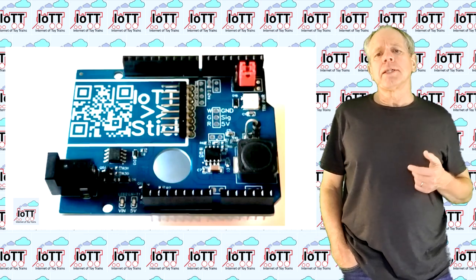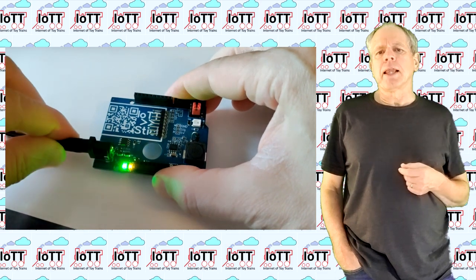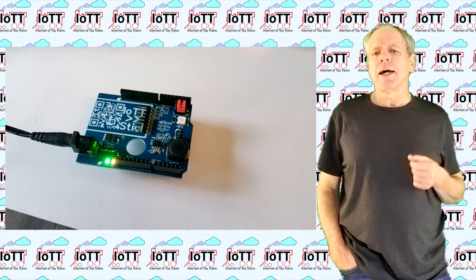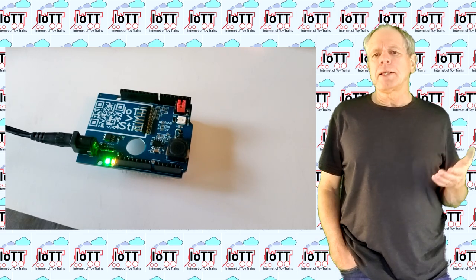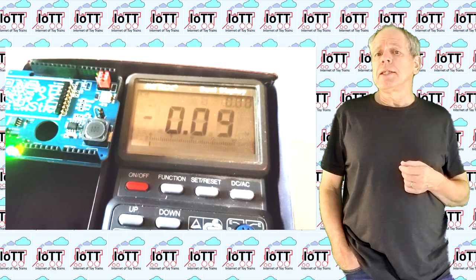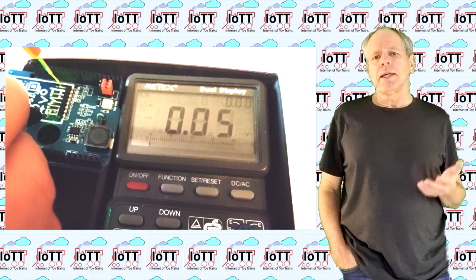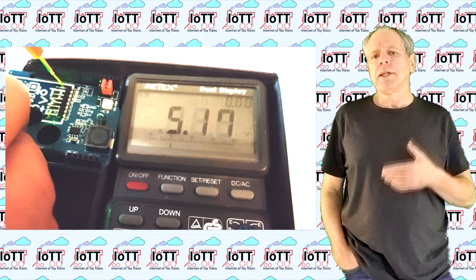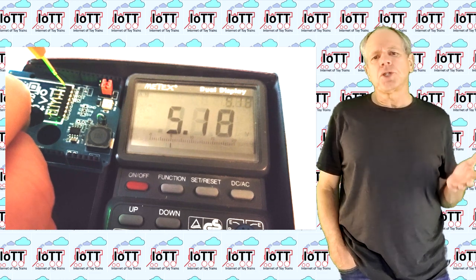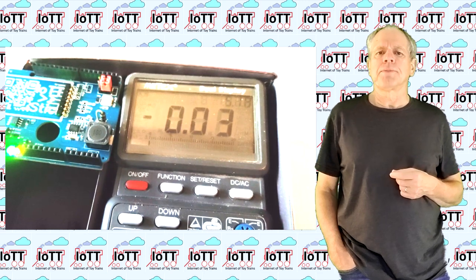Next, we install the DCC AUX board. This board can be tested prior to installation by powering it with a DC supply of 10 volts or higher. Simply connect it using the barrel connector and as a result, both LEDs on the board should come on immediately. As an additional test, you can measure the voltage between the two outmost pins of the IoTT Stick connector, which should be between 5.15 and 5.25 volts.